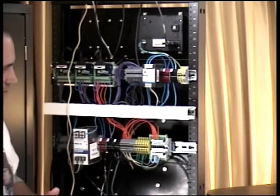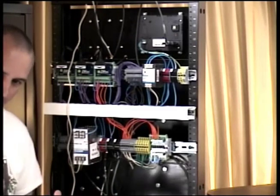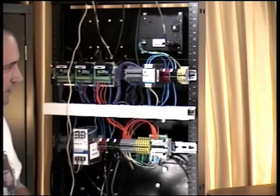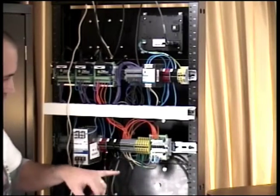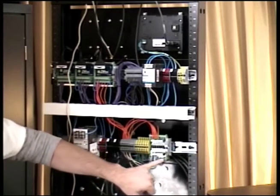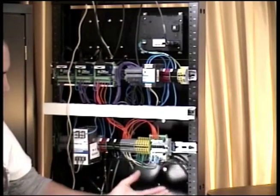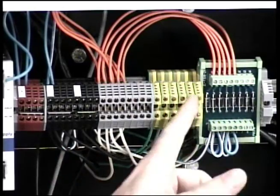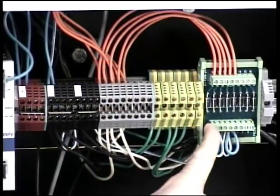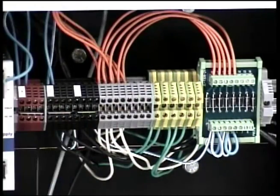What I was going to show is, when Tom was talking about transients or spikes, those solenoids will really create a lot of spikes. Typically solenoids and relays are the 2 major components that would cause this. But he ran through one of these diodes, which is a zip link module that Automation Direct sells. We used to just send out diodes and you'd have to wire up your own stuff, but now you can see we actually have a nice little zip link module. So he ran these through there, which will keep those transients out of the output of the PLC output module.